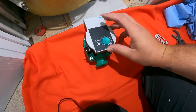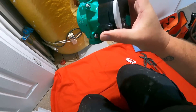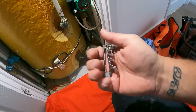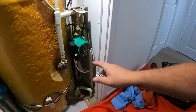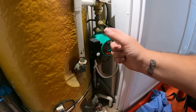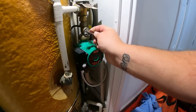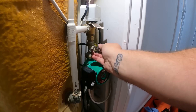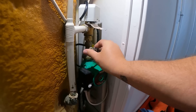These have got a little air extractor button as well - I'm not sure exactly how that extracts air but we'll get it fitted in and see how it works. Handy little tool to have, a little plum chum for getting onto the pump valves. Hopefully when we change the pump, if the pump valves shut off you're laughing - it comes out straight forward. We've got replacement washers. The plum chum is perfect for getting in there. That one seems to be shutting off all right.